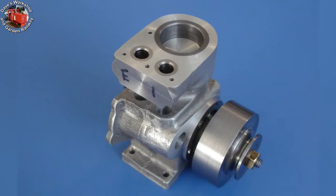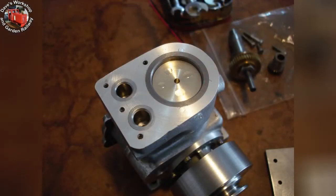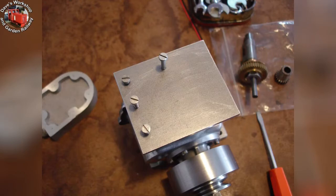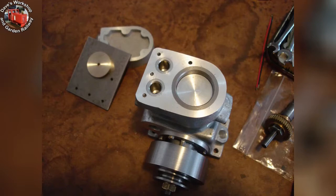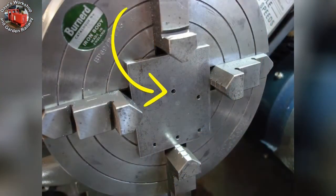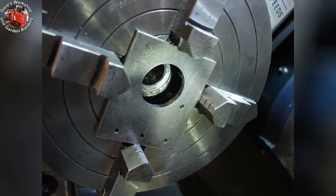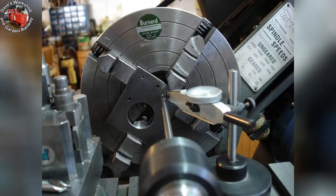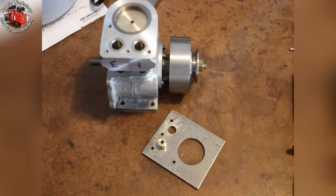The piston is now in the engine. I am making a jig to transfer the holes to the cylinder head correctly, maintaining the correct position of the combustion chamber. I will screw the jig onto the engine and the brass disc with superglue on it will be raised into contact with it. Success — it only stuck to the intended part. A drill will be passed through to get the centre hole; the hole will be bored out to pass the brass insert through. Here is the jig with the hole drilled through from the brass piece. The hole has been enlarged to 1-inch diameter for the brass insert. Now it is time to locate the valves in relation to the bore and tapped holes. Setting up the jig by centering the newly drilled valve hole. The valve insert is aligned with the cylinder bore and tappings; it is now time for the second valve. The valve hole is centered with the help of the wobbler bar.